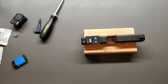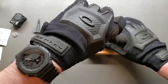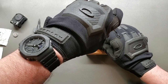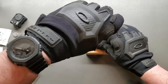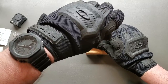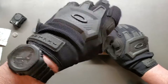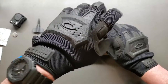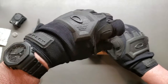Let me put it back in the holder because that's probably pretty darn hot right now — I don't really want to burn myself. Now I'll apply the screw driver. Same thing as before, I'm still going to put it nice and firm and apply torque. Yeah, it comes out pretty easy! That little bit of heat did break the chemical bonds.